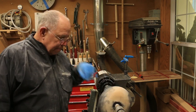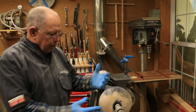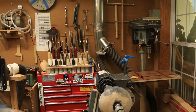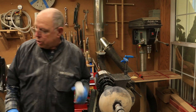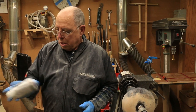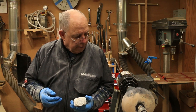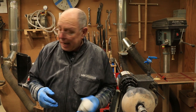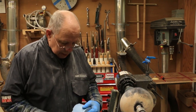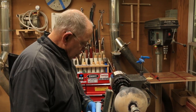What I'm ready to do now is take the green dye and come along and put that right on top of what we have here. It's a Chestnut Spirit Stain, and it's always advisable to shake it up good. This does have a little bit of shellac in it — just an FYI — which helps it set just a little bit quicker, along with the alcohol.